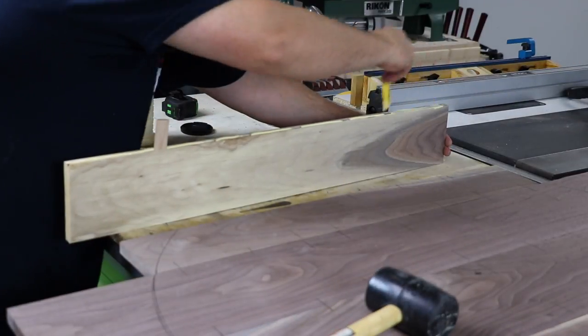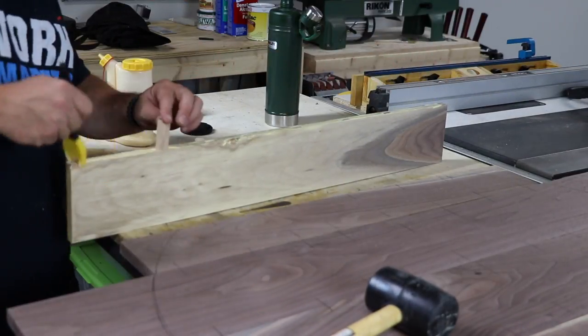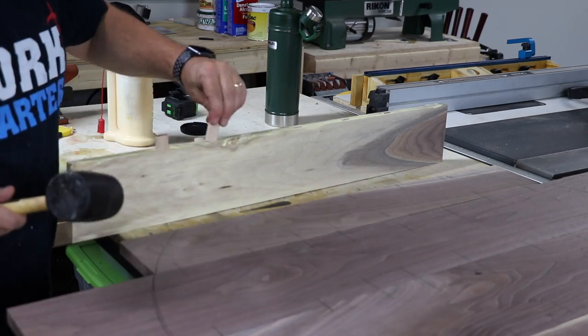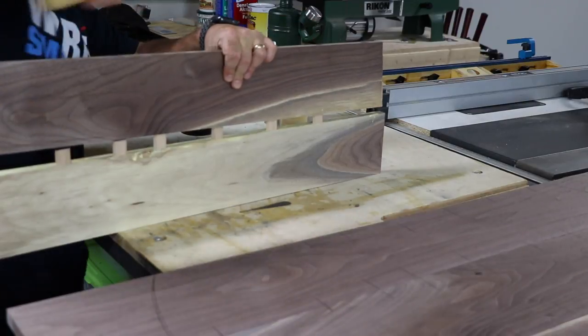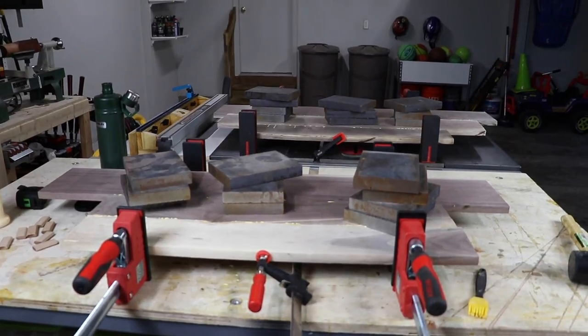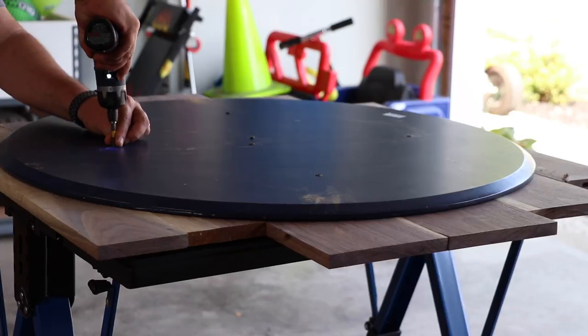What I've done with the dominoes — one side is the standard side which I'm gluing up right here. The other side is a little bit bigger so there is some wiggle room; I can move it around and it can expand. Continue pounding here and here it is with some blocks. I've actually got some steel on it to make it perfectly flat.